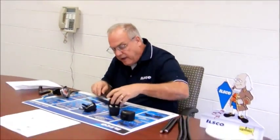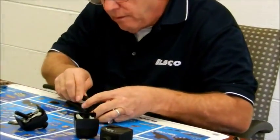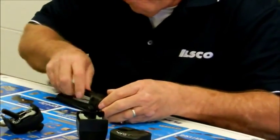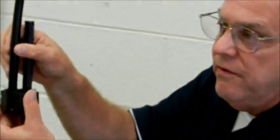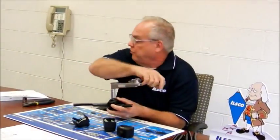And part of the installation instructions, you want to keep the wire straight because it has to be vertically across the teeth. And you put this in place. You have to adjust. Like so. And the wire has to be all the way through touching the teeth. Once you have that in place, and there's my run, then you can tighten it to the required torque, which is also on the stuffer sheet. And you have a connection. This being the main, and this being the tap.